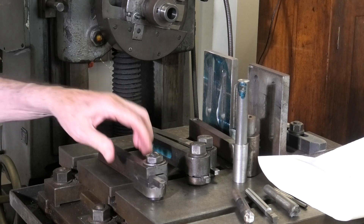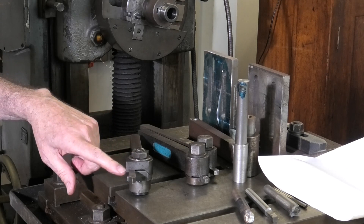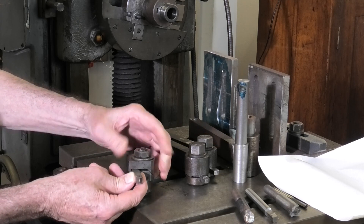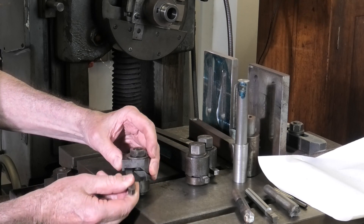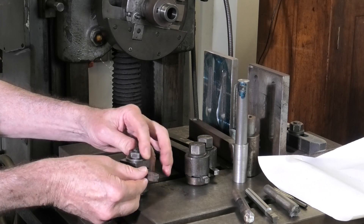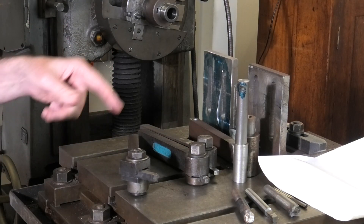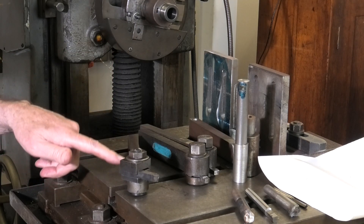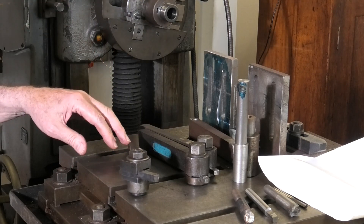It's got a ramp on that side, the tool bit fits on this side. You can run square, you can run round high speed steel. And it indexes around in 45-degree increments if you can get the block to turn. So for shaper work, if you're doing quite a deep box cut, you can do left-hand and right-hand. I usually run these with the tool lagging behind the tool centre, so it gives you a chatter-free cut on the shaper.